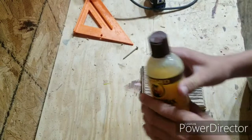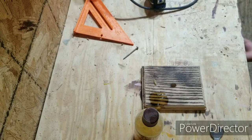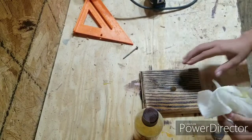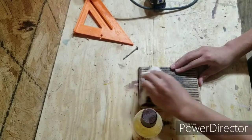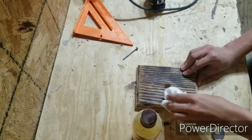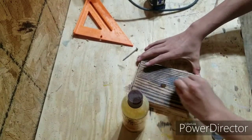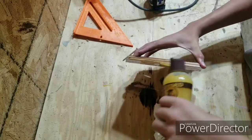So I'm going to be using some Howard's beeswax to give it a little glow. I really like the look of this — I like the smell of it. This is also known as orange oil; it smells like a citrus fruit and it looks really good on wood. One thing worth mentioning is that I probably should have sanded off the charred wood before I started putting the beeswax on, because a lot of that charred wood rubs right off onto the paper towel, and that could have been completely avoided if I had just done a little light sanding before applying the beeswax.